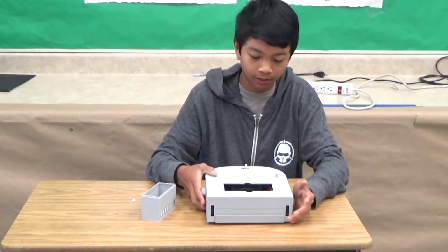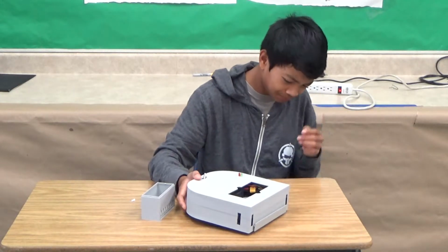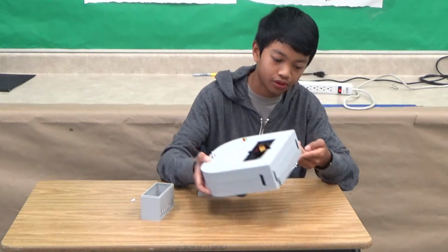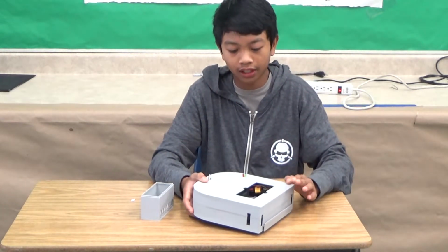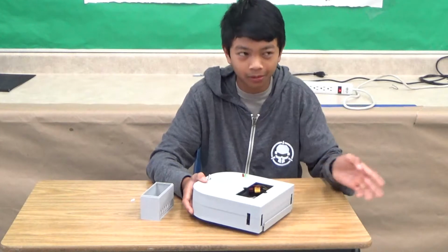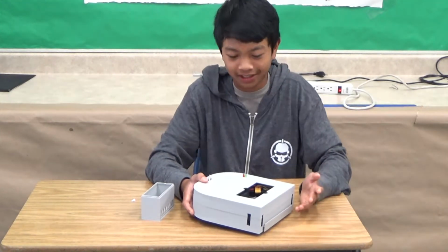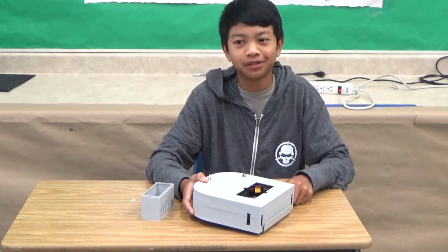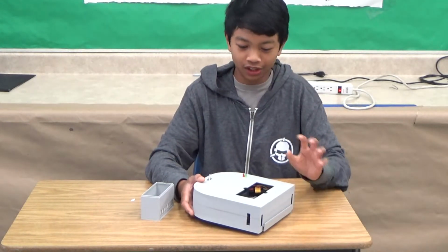What I did there was I had to create my own function called detect ground. Because these sensors are so close to the ground and so sensitive, instead of giving me a solid 1, which means it detects something, or 0, meaning it doesn't detect anything, if you connect it to a digital pin, it sometimes gives you something like 011000111 instead of a solid number.